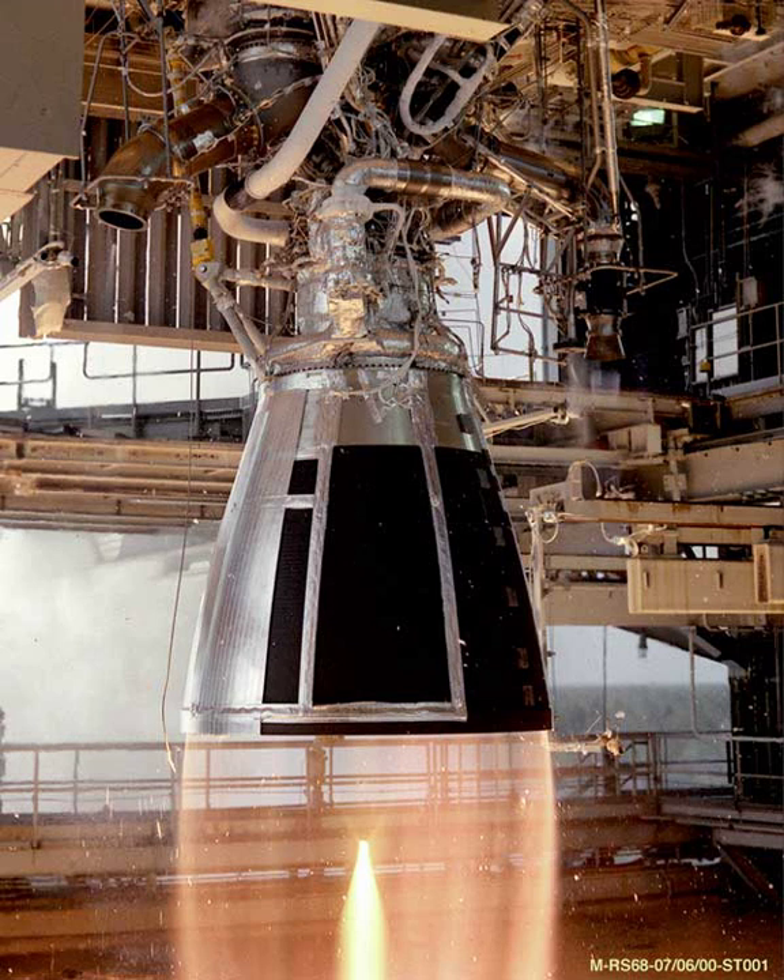The engine uses a redesigned hydrogen turbine — an axial two-stage low-pressure ratio subsonic turbine that operates at 65,000 revolutions per minute, which is between the second and third critical speed. It rests on dual elastic support dampers around the ceramic ball bearings.